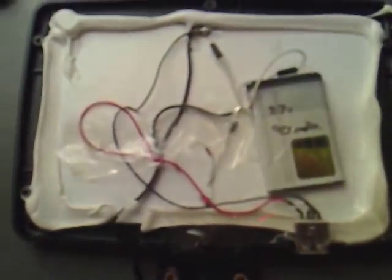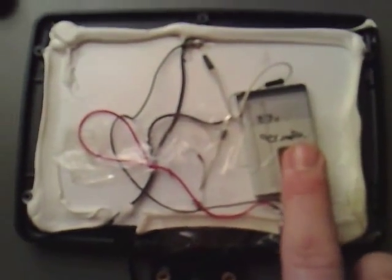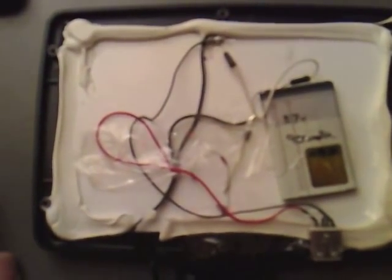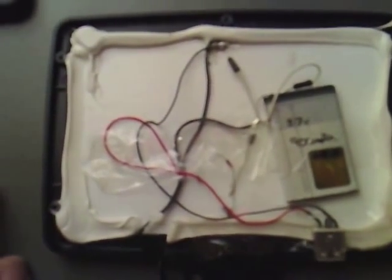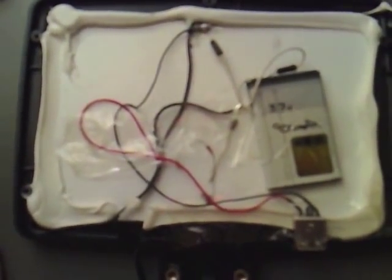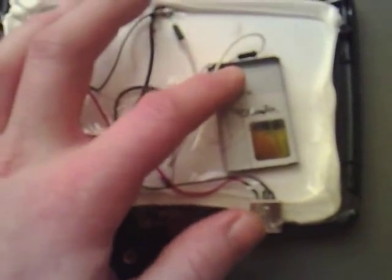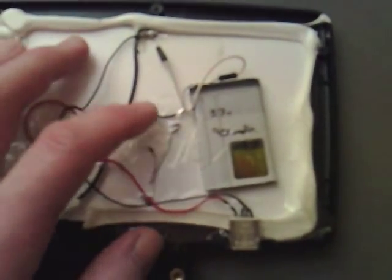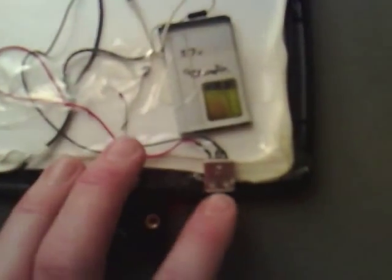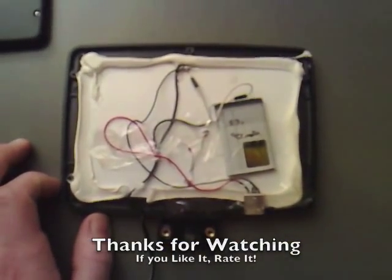Just to give you a quick view inside the solar cell — what I've done is I've put a 3.7 volt 900 milliampere battery there. I'm considering putting two there to make it 8 volts that it charges up to, to make sure that we've got additional voltage to charge the 3.7 volt lamp. All I've done really is hook up a diode straight to the positive, then from the negative to the negative, and then a 5 volt zener diode straight round to the USB socket.